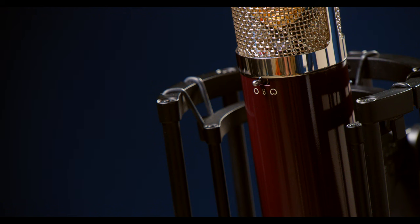Really cool. And on top of this, I can imagine setting one preamp to be overdriven, one preamp to be clean. You could have both the same preamp, but you have slightly different positions of the mic. One maybe more nasally, one maybe more throaty. I don't know, but there's just so many different options you could do by having two capsules that are the same and so close together in one mic. Just a ton of cool options that you can do.